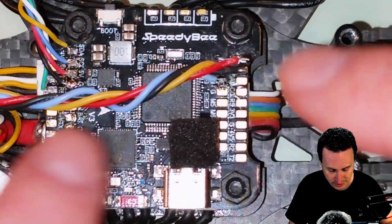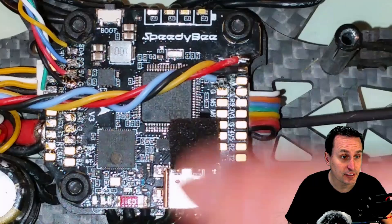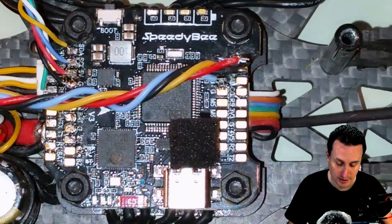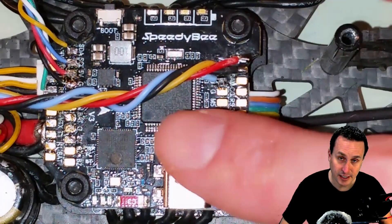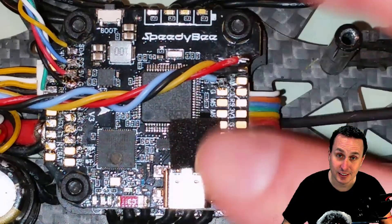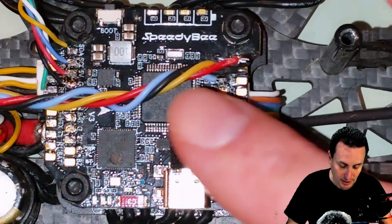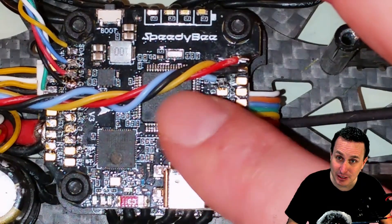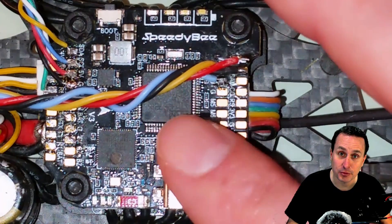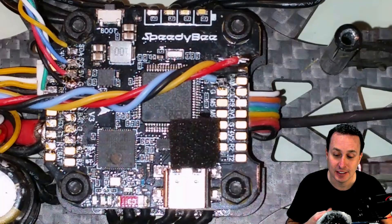That is essentially it. We just want to get some foam on top of that so as air is rushing across — moving left or right — it's not adding noise to the signal and causing oscillations, which get filtered out but ultimately make it seem like the pressure is going up. This will help reduce the influence of breeze, just like the pop filter. Hopefully you found that helpful. If you have any questions, don't hesitate to throw those down in the comments. Thanks everybody, and I'll see you in the next one.